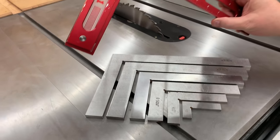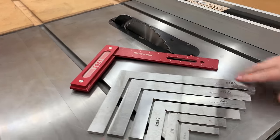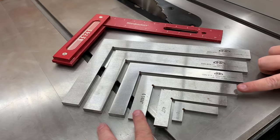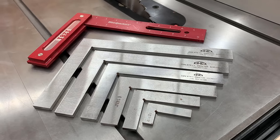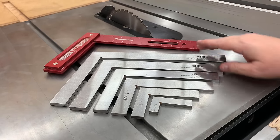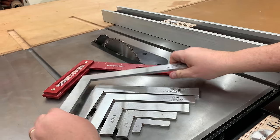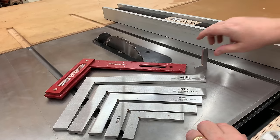There's one other thing I wanted to point out: if you're like me you really like Woodpecker squares, but they're pretty expensive. I like having different sizes available, so I found these stainless steel squares on Amazon. They're not going to dent if you drop them, and they're actually accurate to three ten-thousandths of an inch, whereas the Woodpecker square is accurate to eighty-five ten-thousandths of an inch — so it isn't really close at all. Four or five of these cost collectively about the price of one Woodpecker square. I'll throw a link in the description. They come in the woodworking format with a lip at the edge, or the machinist type without the lip, which is what I prefer.